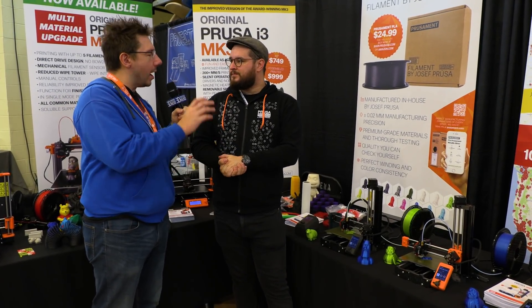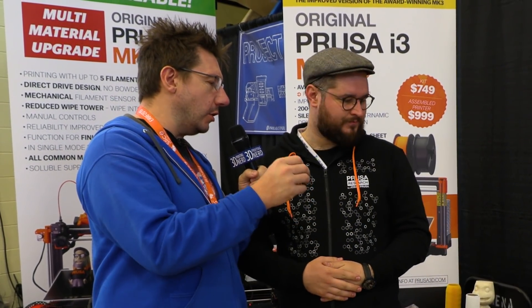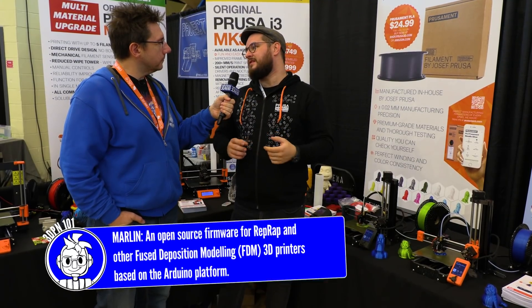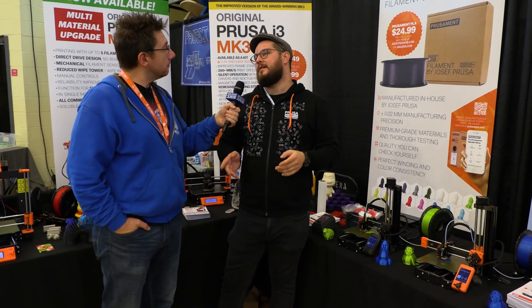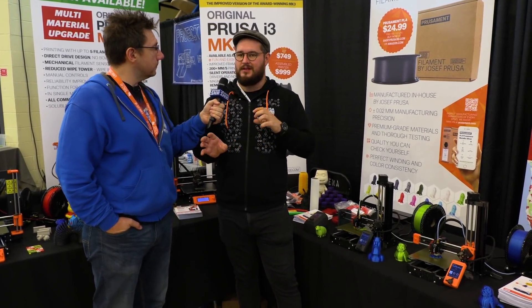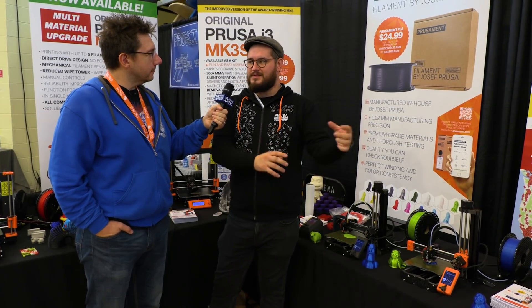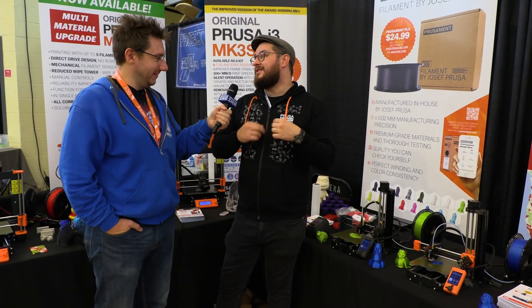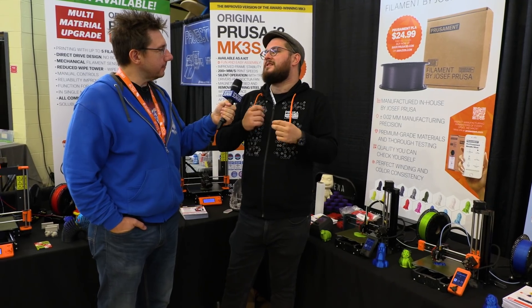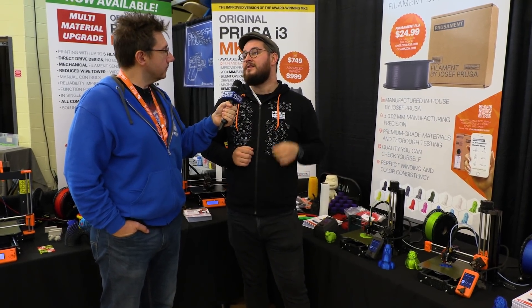We will support ESP Wi-Fi chips — the ESP8266. With the 32-bit board running Marlin 2, there is a real-time operating system: Marlin is one thread, the user interface is one thread, and networking is another thread. This is much more tightly integrated than what you see on Chinese printers, where a touchscreen interface typically means two separate systems talking to each other through serial. With our setup you can do self-test and see everything on the screen as it happens, with real-time data shown on the LCD.